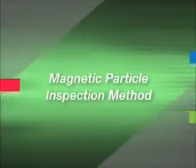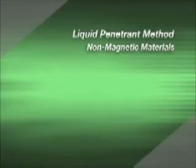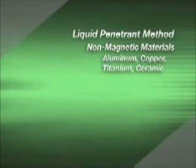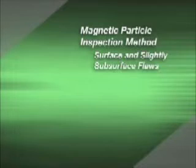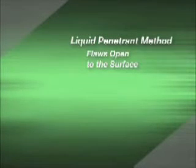When should you recommend the magnetic particle inspection method? The material being inspected is the first consideration. For steel parts or any ferrous metals, magnetic particle testing is the best choice because it's faster and easier. If the parts you are checking are non-magnetic materials such as aluminum, copper, titanium, or ceramic, then liquid penetrant testing is the best choice. The type of defect you need to locate is also important. Magnetic particle testing locates surface and slightly subsurface flaws, while liquid penetrant testing locates only flaws that are open to the surface.